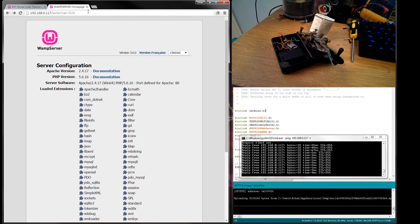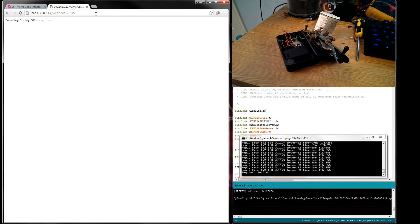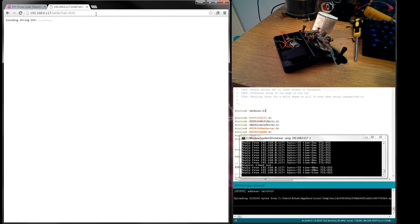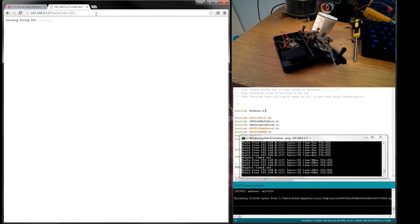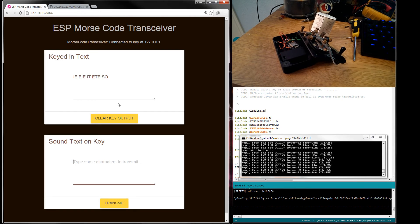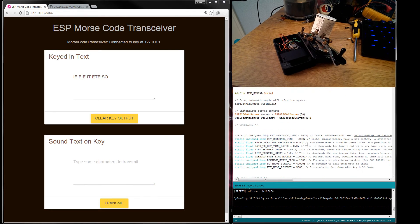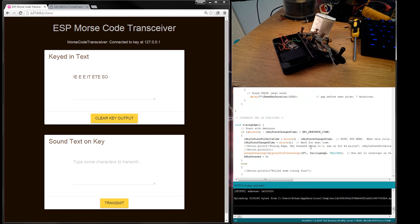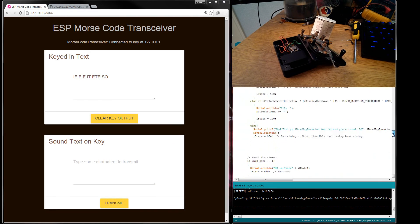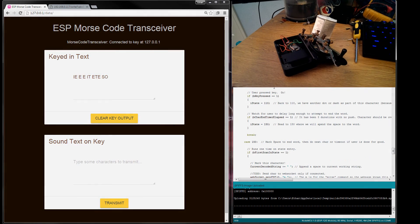I have started implementing the REST API. Basically you can say 'write val equals SOS' and it'll happily sound it away. It's actually adaptive — it'll use whatever base timing you've set at the beginning, or a default base timing. That's about it. It's been about a fun four days getting this coded. We've got Arduino firmware here — it's only about my fourth Arduino project ever, so there's probably some garbage in here that isn't the right way to do things. But I have a state machine to actually receive all the data. It's fully documented on GitHub with a flow chart, and this is all going to be open source, so if you want to play with it...